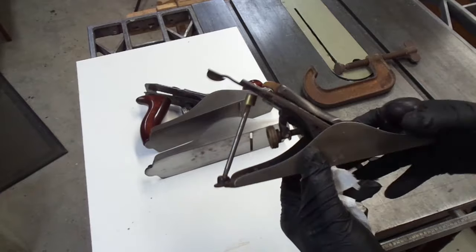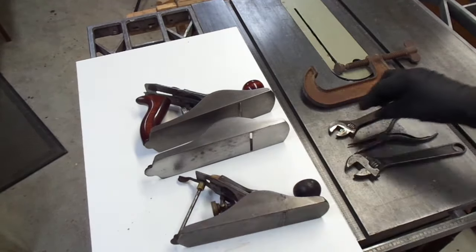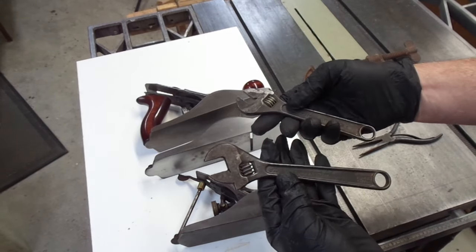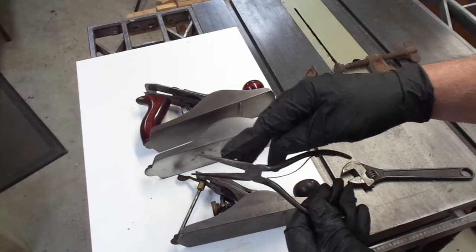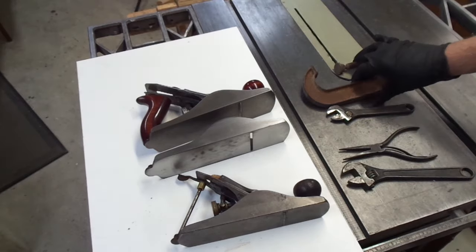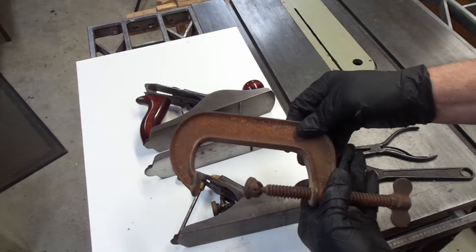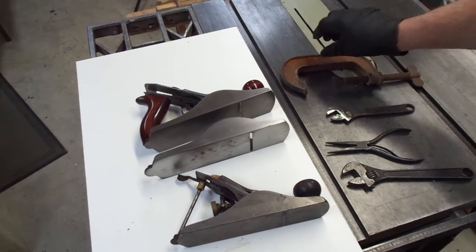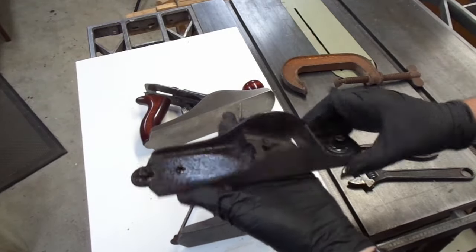I thought I would share the technique to make this look a little bit more like the number 3 or the Defiance. This gray color is a natural patina that forms on iron or steel if the conditions are right. It's very stable and desirable. For example, I have three wrenches here that I inherited from my dad — these things are 60 to 70 years old. And this pair of pliers I used as a boy a good 50 years ago, and for my entire life they've looked just like this. This gray, bluish, dark coating is very stable — it's a form of oxidation called magnetite. In contrast, what we all know as rust is also a form of oxidation, known as hematite, and it's not very stable or desirable. There is a technique to create a patina like magnetite, and it starts by creating hematite and then putting it under the right conditions to convert it to a coating of magnetite.